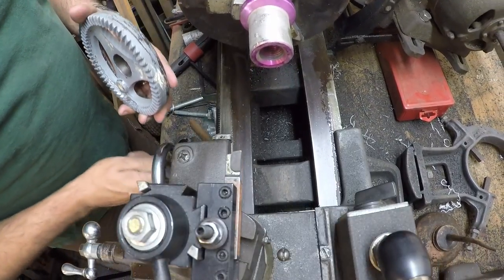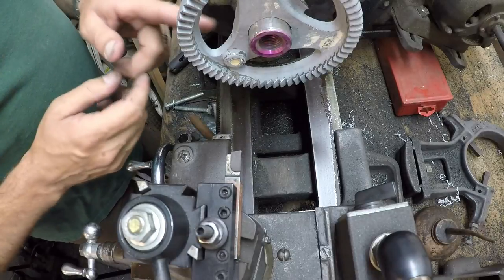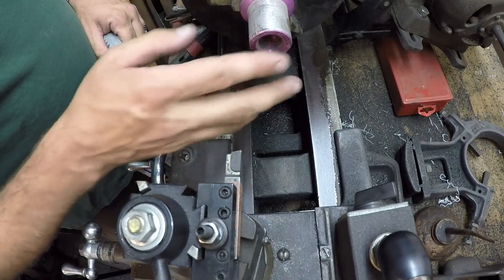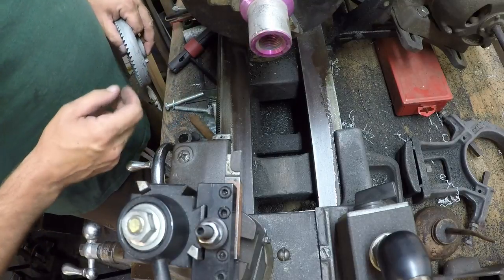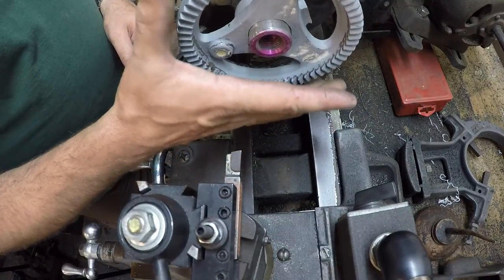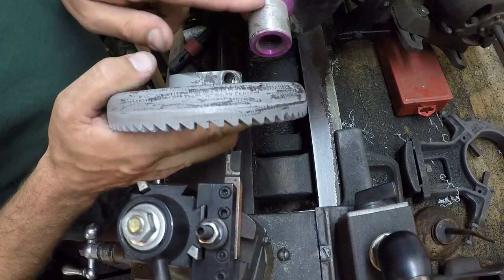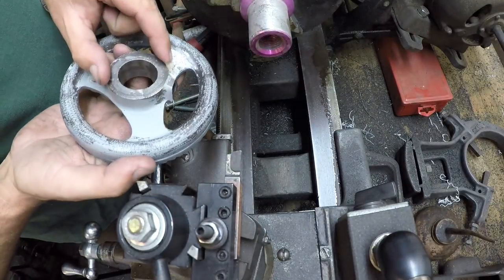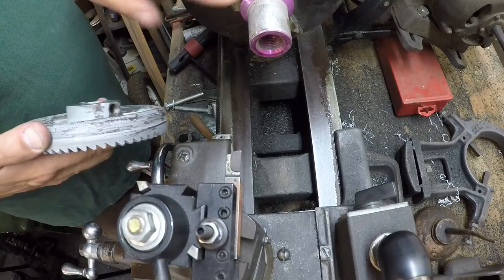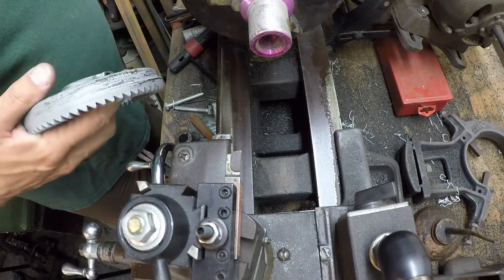I've got you mounted to the compound here, kind of on a ride along. Here's that machined surface — I want that to sit flat to that thing, and we're gonna trim off all this stuff that sticks out here. We'll probably plug that hole with a piece of wood or some putty. Once we get this machined off, it already fits good enough. There's a set screw that goes here, so I'm gonna put a set screw in it. This diameter is actually a little bit smaller, so I'm just gonna putty that, and we'll take just a ruler measurement to see how much needs to get machined off when the new castings come back.